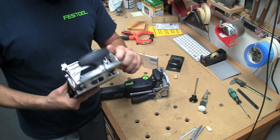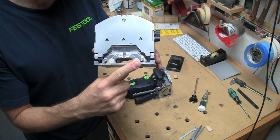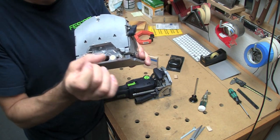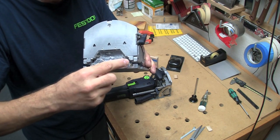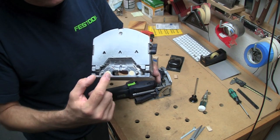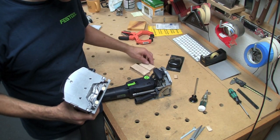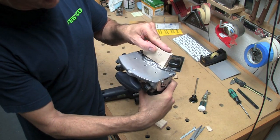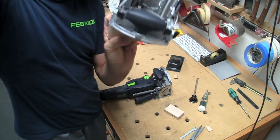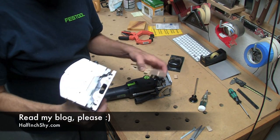For the pin model fence it's a little different. There's a set screw on the side — there's one pin here, and what looks like a slot for a slotted screwdriver. It's the rightmost one when you're facing it, and there's a small set screw on the side. If you loosen this set screw up, you can turn it — it's an eccentric knob, so when you turn it it's going to scoot the pin over side to side. You'll want to mark it to know which direction you're going. For the test in this case, you'd use the two blocks again — top and bottom — but instead of using a line to mark on, you'd place the wood here, slide it over till it hits the pin, do the mortise, then flip the fence for the other pin and do the same. You can then check and see — it's the same type of thing where the offset you see is double the error, and that's what you correct.